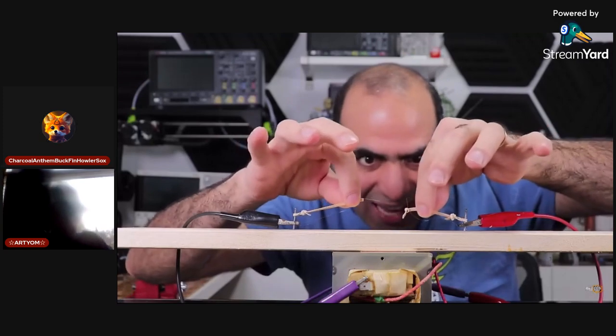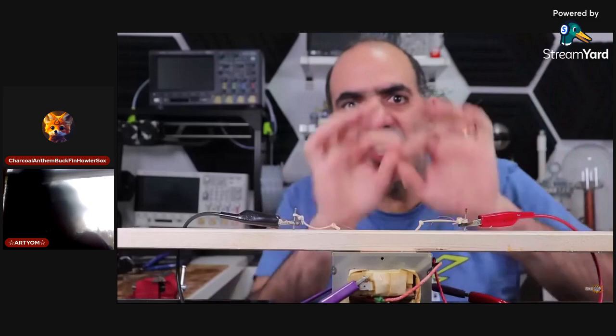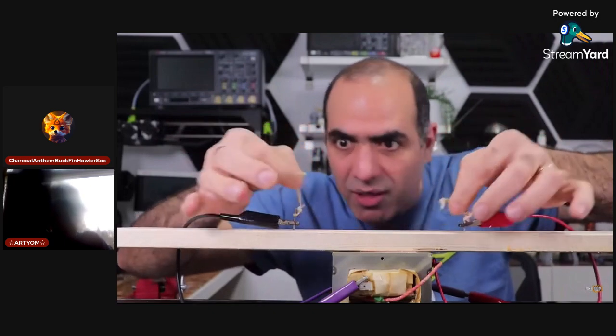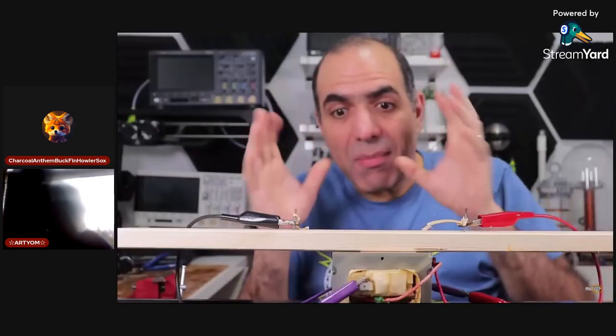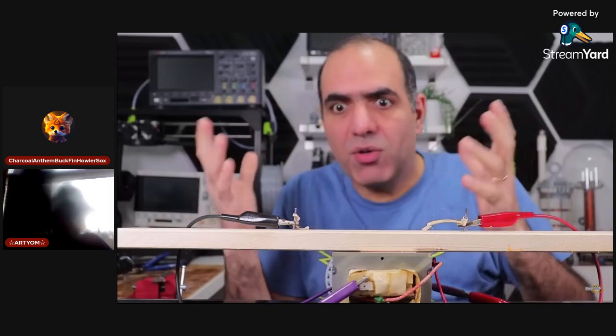Look, this is exactly how you expect a fuse to behave. Unlike the last time that the entire wire just evaporated, this time it just broke straight in the middle. The rest of the wire is intact, and there was no huge arcs either. Awesome! So any mechanism that quickly breaks and pulls wires apart should be very good for high voltage.